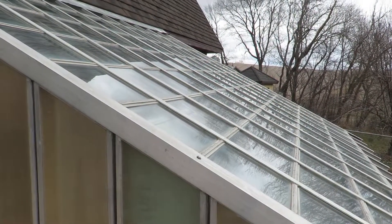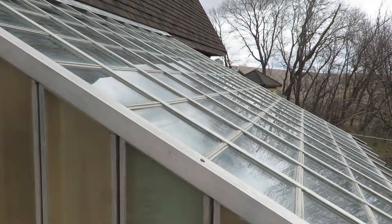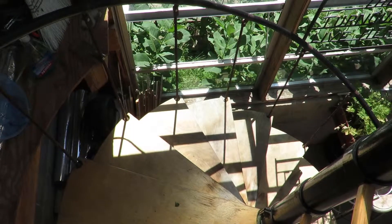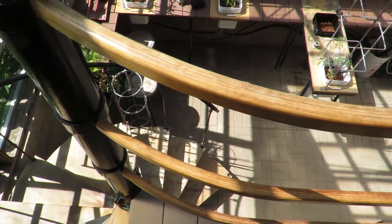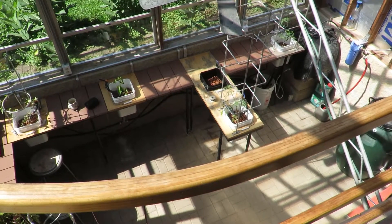The interlocking system has been working really well. I put some flashing across the top and it really holds it pretty good. Because they're aluminum, I thought there'd be a lot of thermal expansion between wintertime, so that's why I had those little adjustable hinges. Now here's the mistake: I used plywood for the spiral staircase, and plywood does not hold up in this humidity — it's like it rains in here during the wintertime. I should have made it out of decking material, and I'll probably redo that.